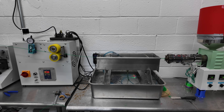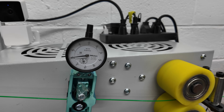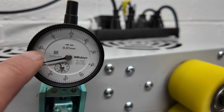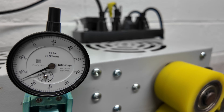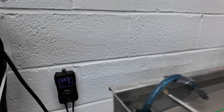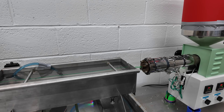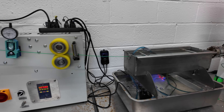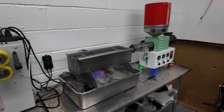Once it's up and running, there's very little maintenance — you just come in and change out the spools every 35 minutes or so and monitor the dial meter. Around the 90 mark is where it's 1.75, so it'll fluctuate plus or minus for a while. As the filament passes through the water bath, the temperature is set to 70 degrees, but it'll warm up and eventually stabilize around 75–77°C, which may cause a slight variance in filament diameter. That is the process of how I start up the extrusion line for the day — leave any questions or comments below and I'll see you in the next video.